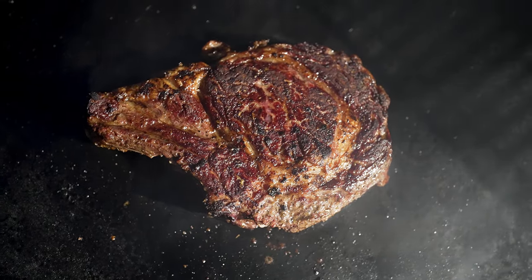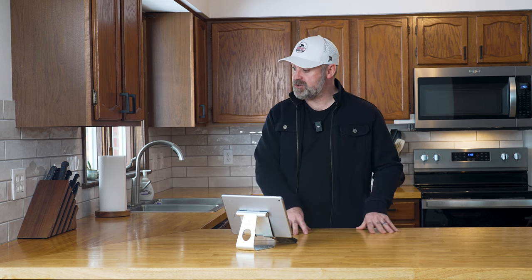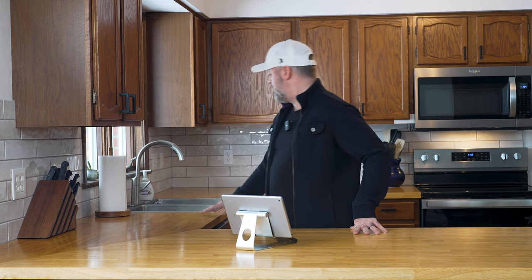For installation, my buddy had a track saw. I invited him over with the lure of a Cajun reverse-seared three-inch-thick ribeye, maybe some beers and bourbon. I actually wish I had taken footage of the installation process. With the help of friends and a very nice track saw to make the cuts beautifully straight, we were able to cut and install it in one and a half days — including sealing the bottom out in the garage with a spray shellac. The bottom near the dishwasher and sink is moisture-sealed, which you must do. We joined the diagonal and straight cuts with biscuits and wood glue.